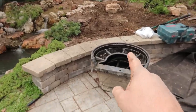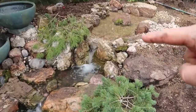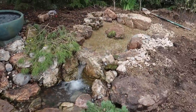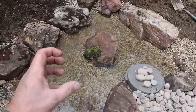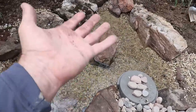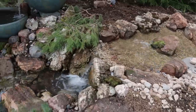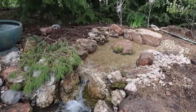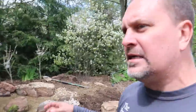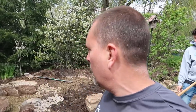This is what we pulled out of there - that Bio Falls 2500 - and it was replaced with this wetland. This wetland right here is probably ten times the amount of efficiency. There's nothing on the planet that will filter a pond as good as a giant wetland like this, filled with big gravel and small gravel and the constant upflow through the aqua blocks going through the gravel and going back in. A project like this with all the Missouri moss rock, stone, excavation, liner, underlayment, snorkel, centipede, and aqua blocks would probably run around $7,000 to $8,000. This is the premium filtration system for a water feature.